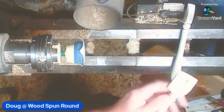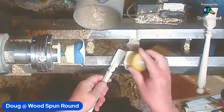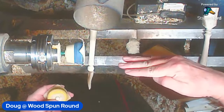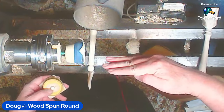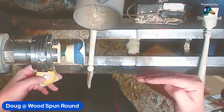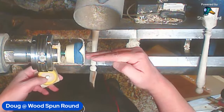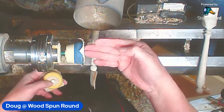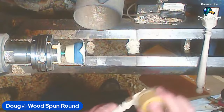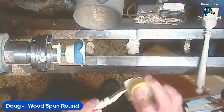Evening, prof. For instance, when Richard's doing an end grain bowl, he takes his spindle gouge, and instead of going in the center and pulling out, or even from the outside and going in, he goes in and then goes up to the top and brings it back down the other side. The other side is what's getting cut. Now, that is the proper explanation of a back cut.